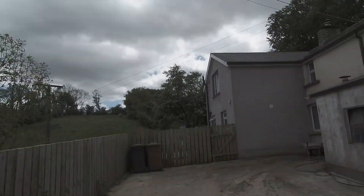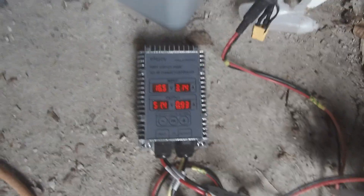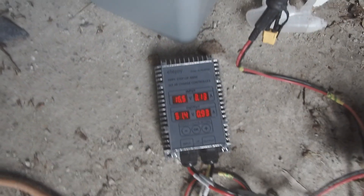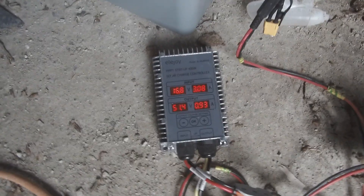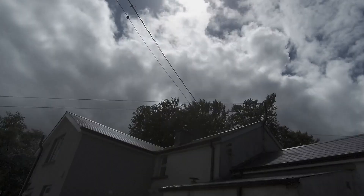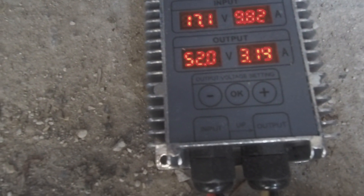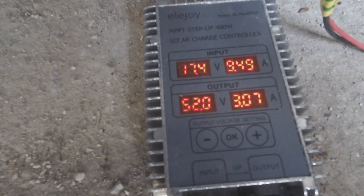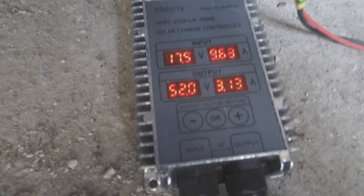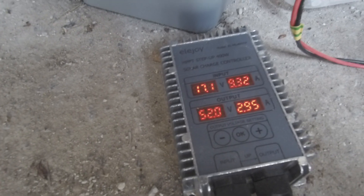So it's an overcast day. This is the 300W — or 320W — panel. Even going into the shade we're still getting 3A. What I've noticed is that the 300W versus the 100W: in light where there's not direct sunlight, you get a lot more power out of it, which is obviously a benefit. I'm getting near 1A there and it's not even fully cloudy.